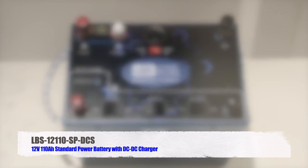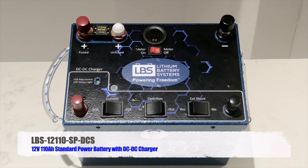This battery is smaller in volume, has more amp hour capacity, and is nearly a third of the weight. Inside the aluminium case there are four cells — prismatic in shape, each at 3.2 volts and 110 amp hours. When you connect four 3.2 volt cells in series you generate a multiple of 3.2 volts, giving you 12.8 volts — hence the 12 volt battery — while the amp hour capacity stays the same.